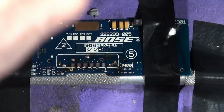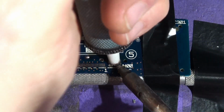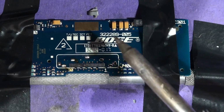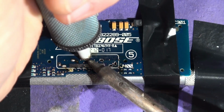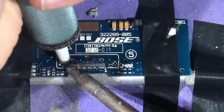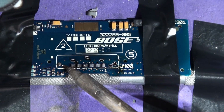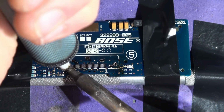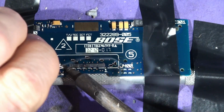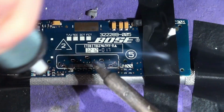Nah, it's going to be a solder sucker. You're going to have to invest in a £2 solder sucker from Banggood. On the thinner boards, like the 1mm boards, you can do that with the braid, but not today. She's not playing ball with us. Sucky, sucky. That one's not liking it, is it? Let's put some nice leaded solder back in that hole to make a nice alloy, and then clean it out.